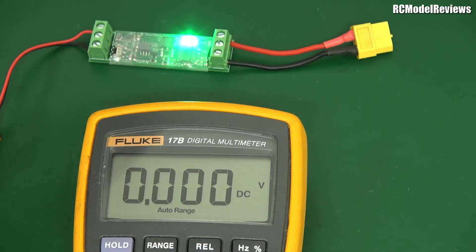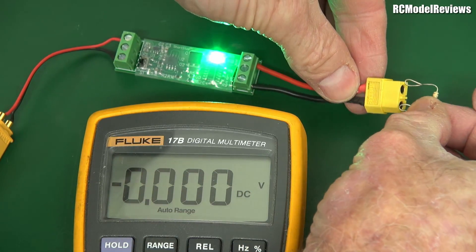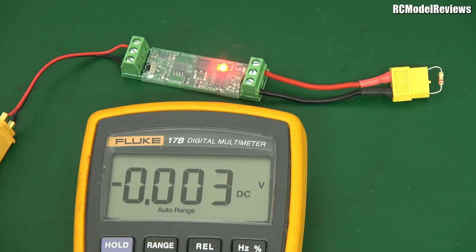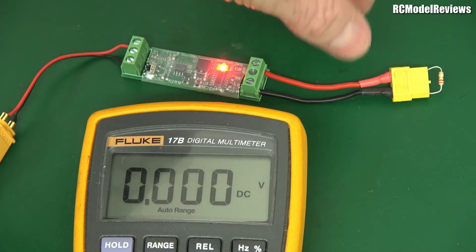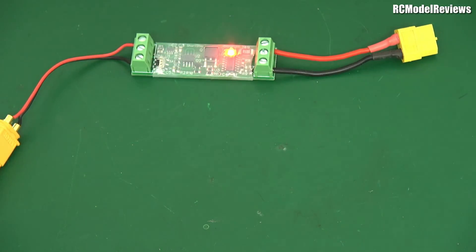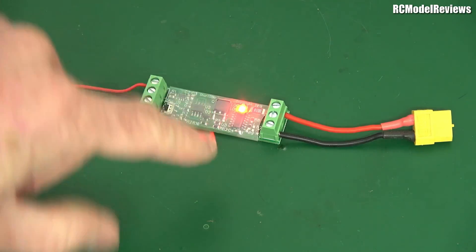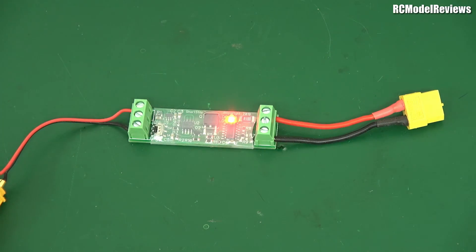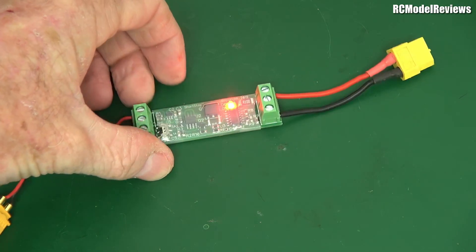Just to prove the point, I'm going to remove that resistor and cycle the power and plug it back in. Green light. And if we measure, we should have the full battery voltage appearing on this connector - good nearly 12 volts. It says 11.41 volts. So that has basically detected the fault and stopped our little resistor from frying. I wonder what happens if we put on the fault after it's gone green - will it actually trip? Yes, look at that. As soon as I put the fault condition on there, it tripped out and went to red. So it's like a fuse. If I remove the fault, will the power come back on? No, it doesn't. Because what it says is there's a fault in here, so we don't want to reapply the power just because the short circuit has been removed, in case there's something else. Because if it did turn itself back on, something could blow up like your video transmitter, and that clears the fault, so the power goes back on and then it blows your flight controller. So it's a very smart piece of kit.